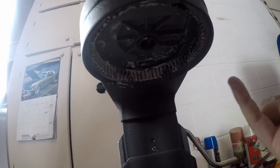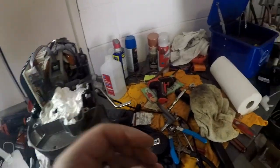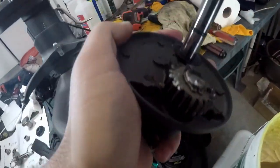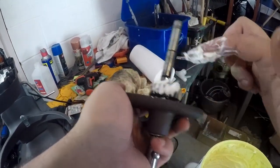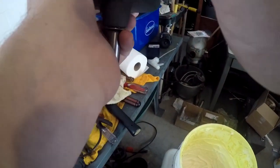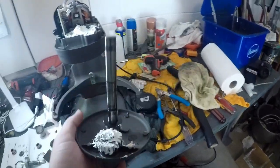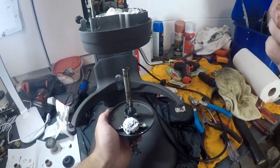Once you have that lower outer gear coated up, we're going to come back up to the top. What we're going to want to do at this point is also put a little bit of grease on this gear right here. It doesn't have to be a whopping amount — we just like to put a little bit on it, get a little bit in between each tooth, maybe a little bit on the top. Nothing crazy, just a little bit.